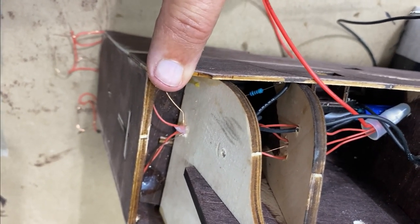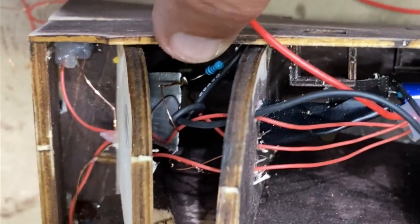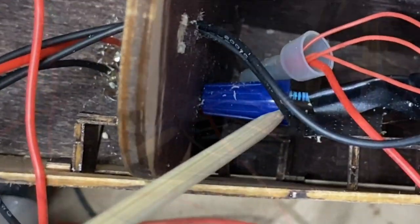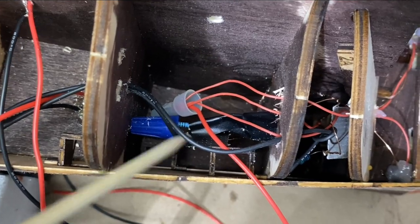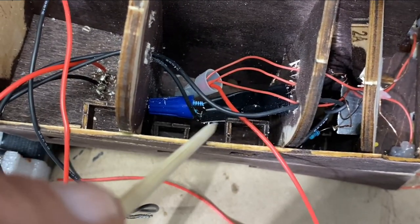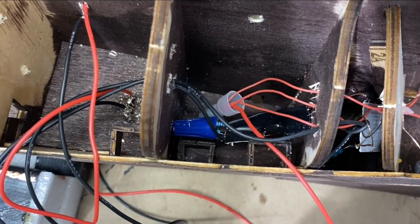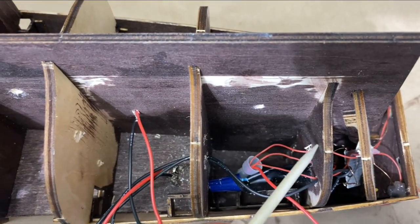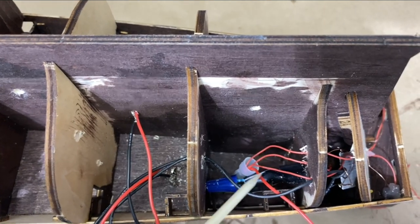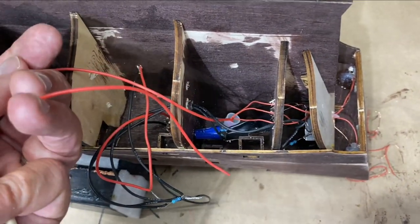I tried using some wire from the kit on the positive side but they were a mess and at risk of touching each other, so I stopped using it. You can see I put some clear caulk in there so they don't touch. What I have here is one resistor going to the top lamp and the other two hooked up higher. I've got a black wire going in and two resistors — you can see them there. I separated the wires with some black electrical tape so they don't touch. That's the three resistors for the back lanterns. These are the three negative lines from all three back lamps — they hook together and come into just one negative that goes to my power source.